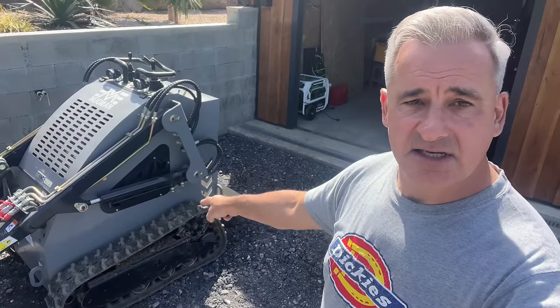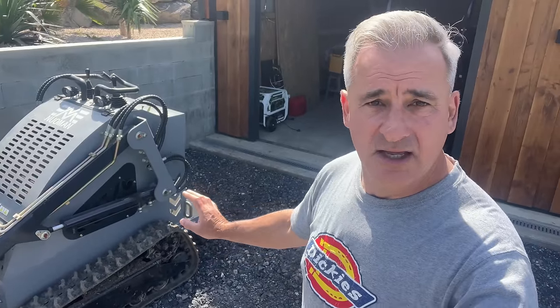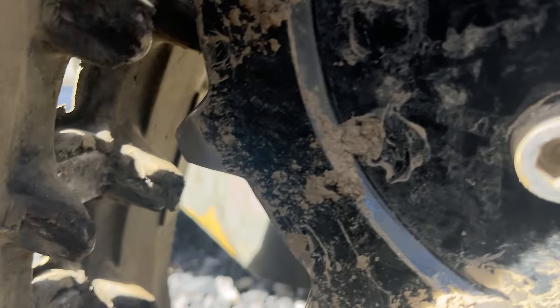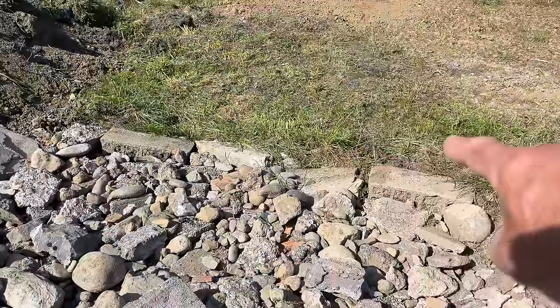First project today — if you've seen in the previous videos — are the skid steer tracks. I've had a problem: I've got some stones stuck in there and basically just tried to get them out by going backwards and forwards, and that's damaged the little nipples inside — the little guides that hold it onto the guide wheel. On one track, which is the other side, it has come off six times now while I've been working. So I've bought some new tracks, bought them on the internet but they came from France. They look a bit sturdier, a different design — they've got a wider guide inside so I'm hoping that will stop it popping off all the time. It's quite a sturdier rubber track and I've got to get some more turf off for the bottom of the driveway to make that nice and level before we get the gravel in.